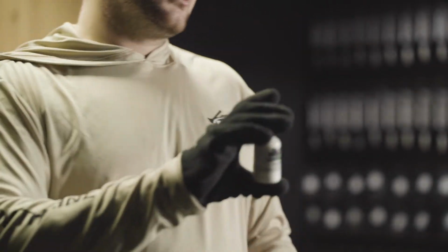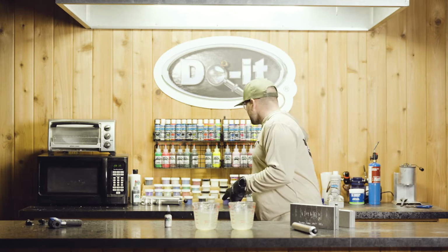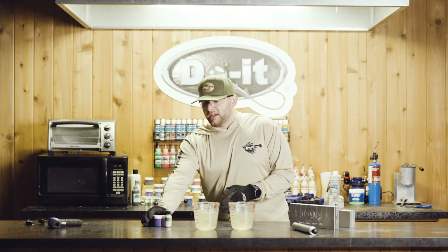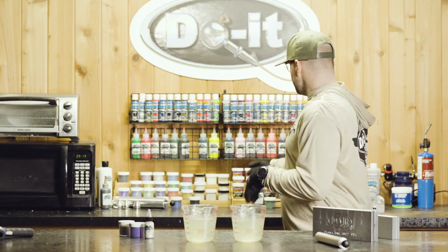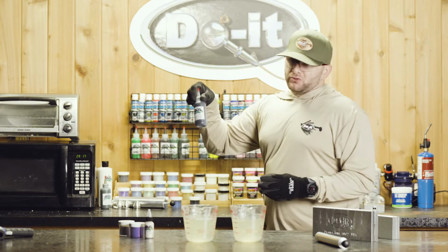For that swim bait, we're going to be using this Pearl Essential Series colorant. That's going to give you a pearl whitish base. Then we're going to be using some 0.015 light purple flake, as well as some violet pearl highlight powder. This is all mixed together, is going to give you kind of that pearlescent, little bit of purple swim bait, which is really good up north when you're fishing around alewives, or really good down here for like that lavender shad sort of color.